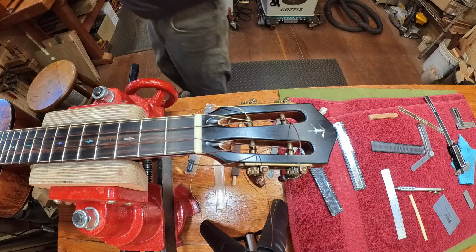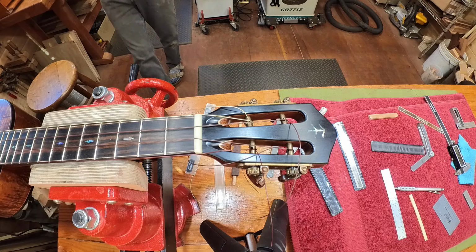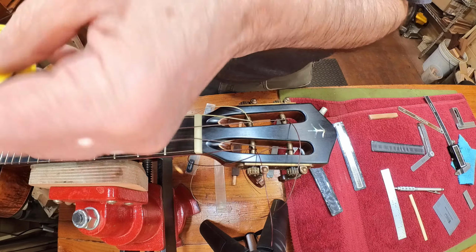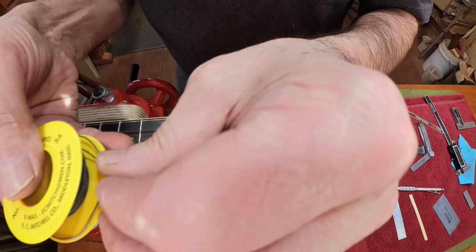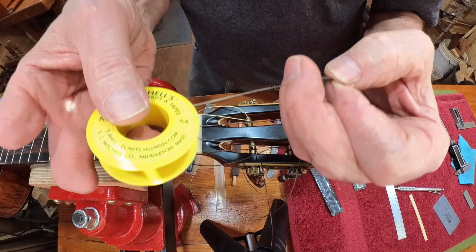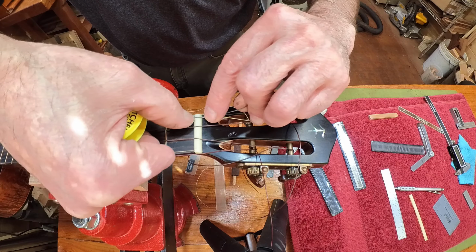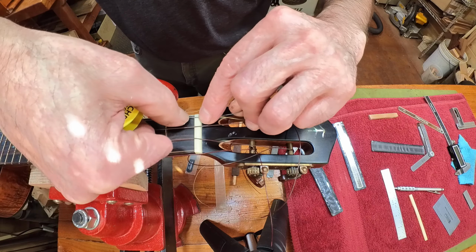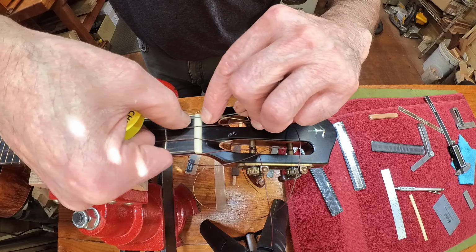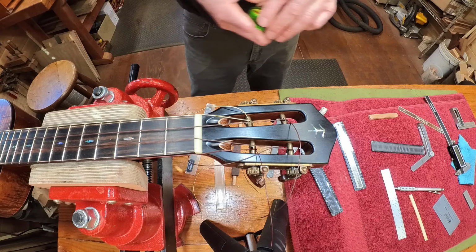But I find that if you take just a small piece of, I've got this Mitchell's abrasive cord, which is a string that has an abrasive action to it, we can come into our slot like this, and we can just basically sand the edges of it a little bit, just to make sure that it's really smooth, and then that way there won't be any issues with the nut